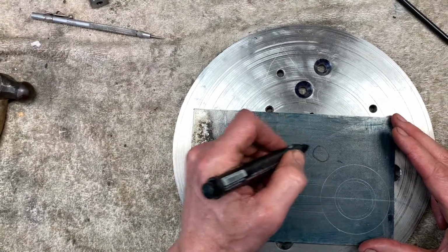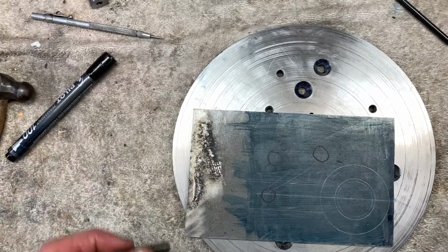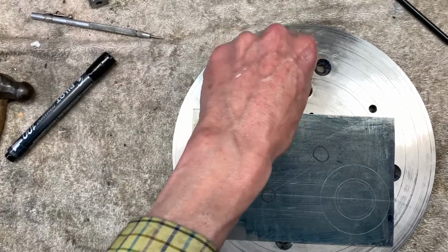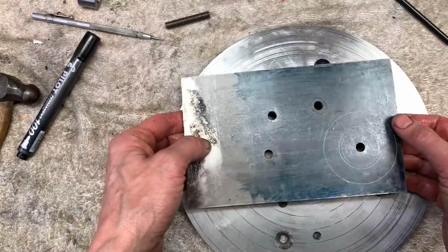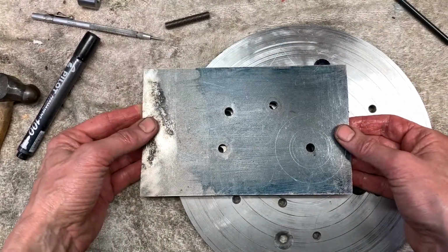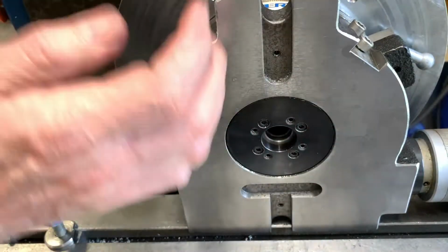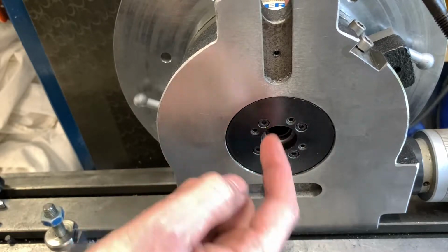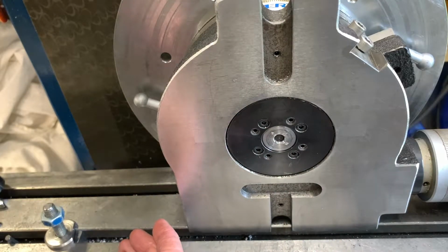1, 2, 3, and this is 5/16 tappings, so I use an 8mm drill. So I'll 8mm drill those there. Okay, so I went for 4 8mm drilled and reamed holes. This little bushing fits flush on the bottom of the rotary table, picks up on this boss, so that I can actually use a through bolt later on in the process.